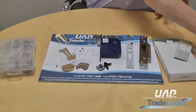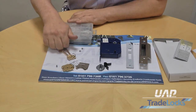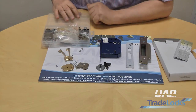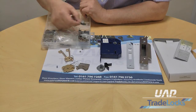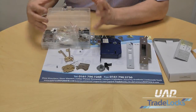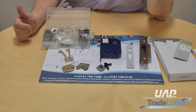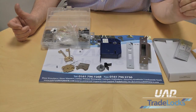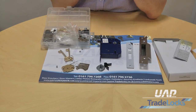Another thing you can get from us is this service kit. Within the service kit there is everything you will need to work with our mortise locks if you want to get involved in keying alike. We supply new stumps, new mortise curtains and springs, and a whole host of different lever packs. So everything is in here to service these locks and then to offer your customers a key-alike facility, a key-alike in pairs facility, and even an upgrade and repair service if that's ever needed in the future. So overall that is the UAP maximum security mortise lock range.